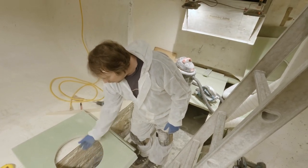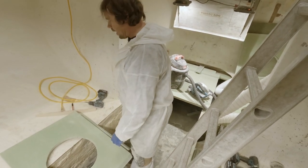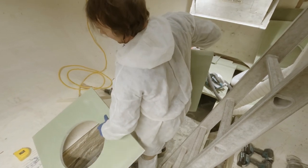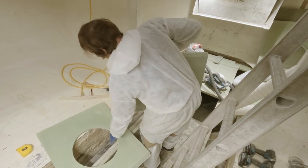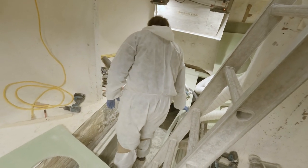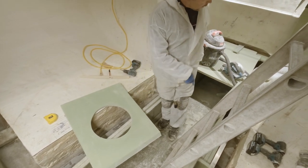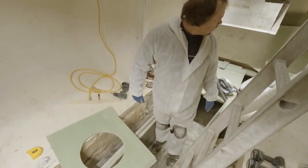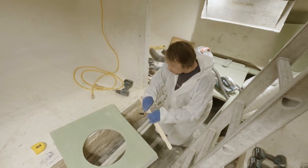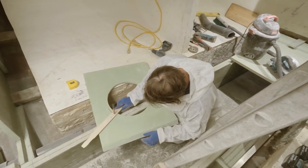If the fabric won't stick to one side or the other, put a nice radius on it - probably three-eighths inch radius is enough, but half inch is better. That's about what these will be. My mark is three-quarter inch, but I won't quite hit that whole width, so it'll be somewhere just around half inch.